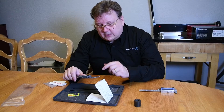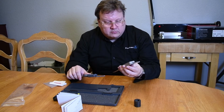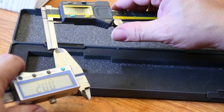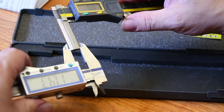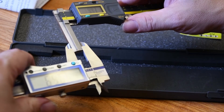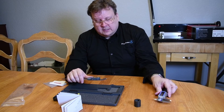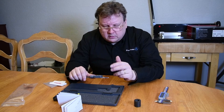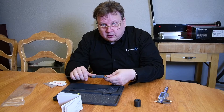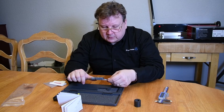Now the minimum size that we can measure — I have my other favorite caliper, which is their Bluetooth 4-inch caliper. When I put them together, the minimum size is about 10.5 to 10.6mm. So anything smaller than about 11mm on the inside diameter is going to be too small for these calipers, but anything from about 11mm up to 150mm or 6 inches will work fine.